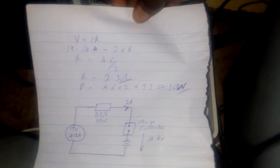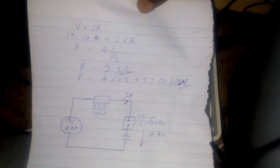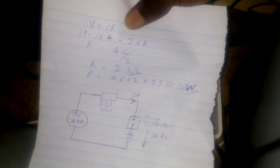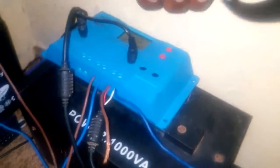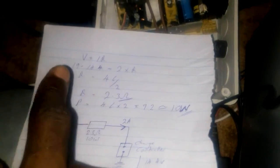This is the calculation you use to determine the rating of your resistor — a simple calculation: voltage equals current multiplied by resistance (V = IR). The output of the laptop charger is 19 volts, and I want 14.4 volts to come into the charge controller. So you subtract 14.4 volts from 19 volts to get the voltage drop across the resistor.